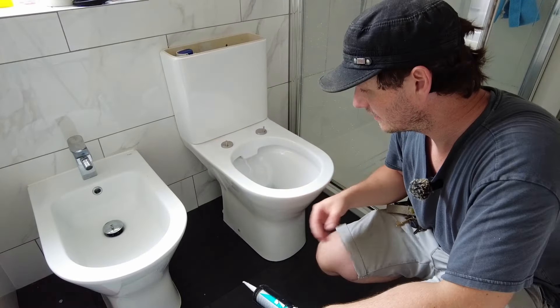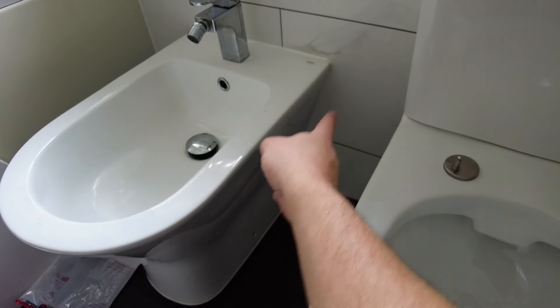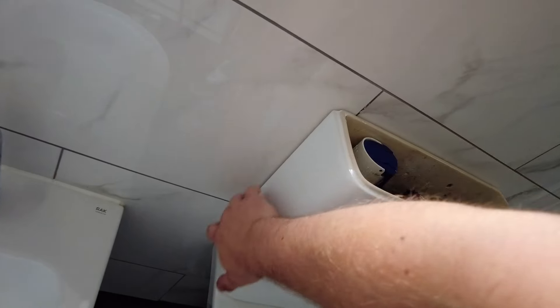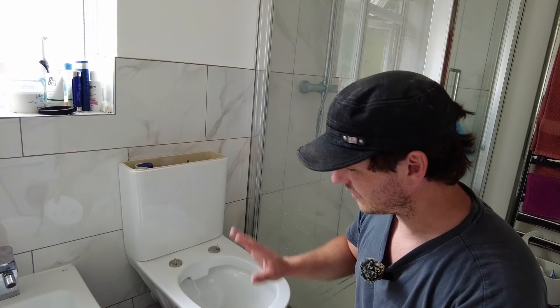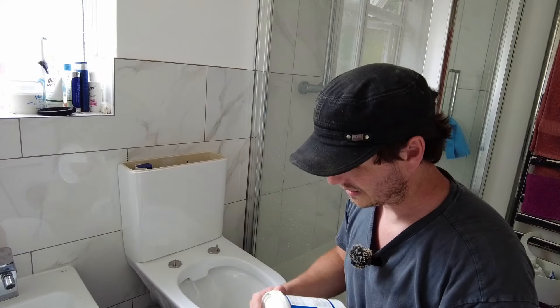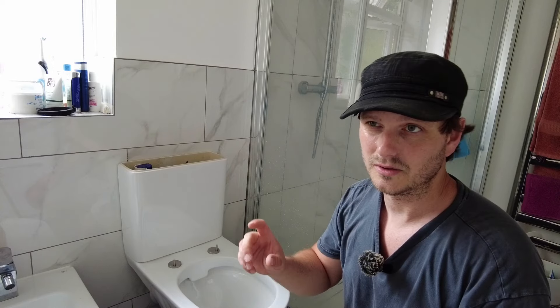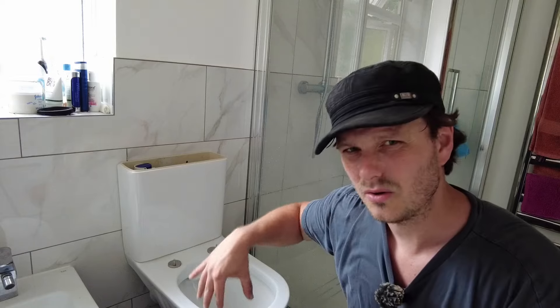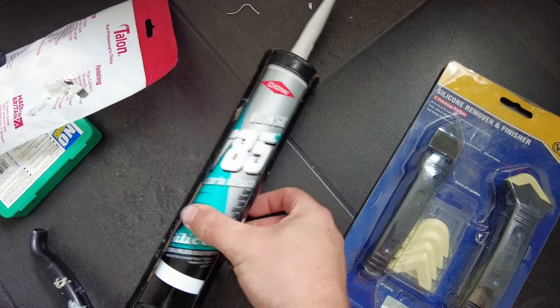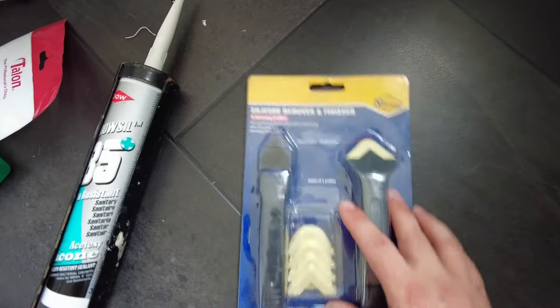The pan doesn't go all the way to the back, unlike this bidet that is sealed all the way around. I'm just going to silicone round the perimeter here. Make sure your area is properly cleaned — I've taken off all the old silicone, you need to get rid of that if you're refitting your toilet. If you're fitting from fresh, that's fine. You should really use methylated spirits, but I forgot mine. It's not too critical here, but if you're going around your bath or shower, make sure you use methylated spirits.